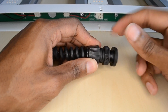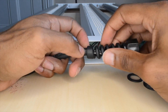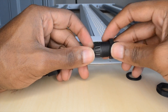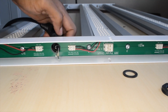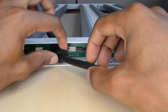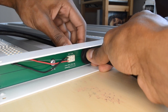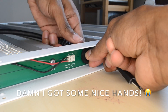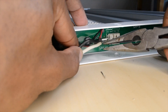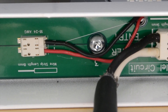Disassemble the strain relief cable gland, feed it through the hole in the u-frame, then slip on the rubber gasket and the nut. Hand-tighten the strain relief gland from both sides of the u-frame. Insert the white cable into the positive side of the main power connector and the black goes to negative.